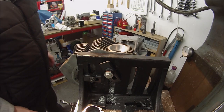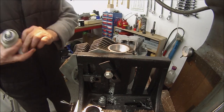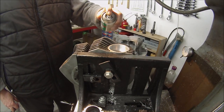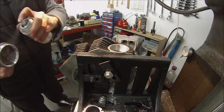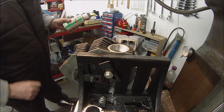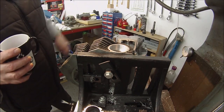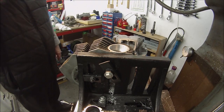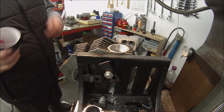Right, thoroughly cleaned off on both parts. Spanner at the ready, insert tool at the ready. Again, as previously, a little bit of activator. And because we're on aluminium to aluminium, and although it's anaerobic to a degree, it also relies on some ionised thing, copper ions or something, I think I read a while ago, to cure the Loctite. To give that a moment to evaporate. Well, I'm just finishing my tea off.